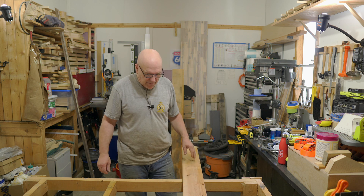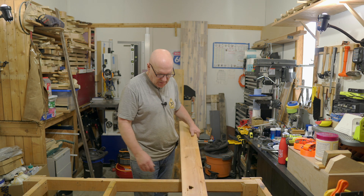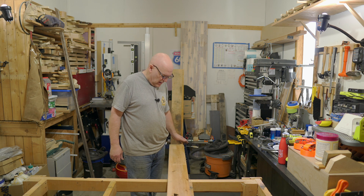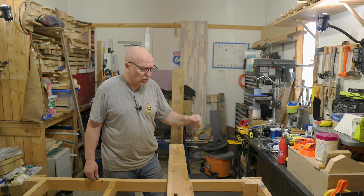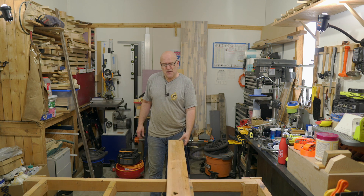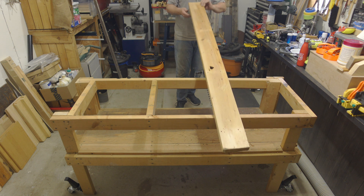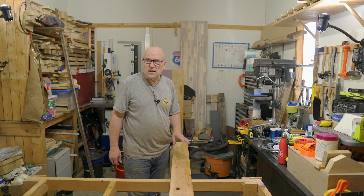I got those four planks off — I wasn't being too precious about it. This is a very old workbench, already has lots of nicks and dings. There are two places where there are holes; don't really know what for. They're triangular, not really round — maybe some kind of dog hole or something. There are some screw holes too. I had a vise mounted on here for a while and my old drill press mounted on here too. So I'm not really too worried about little nicks and dings, and I'm not going to try and make a perfectly flat top. None of these boards are twisted, but they do have a bit of a bow and a couple of them are cupped a little bit. I'm not going to be too fussy about this, but I am going to run these through my planer to clean them up a bit.